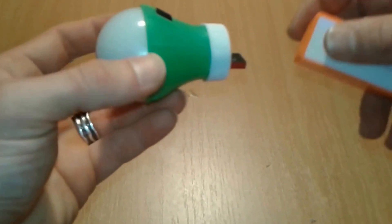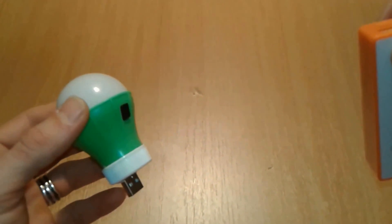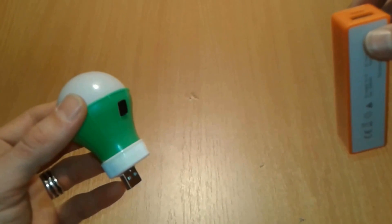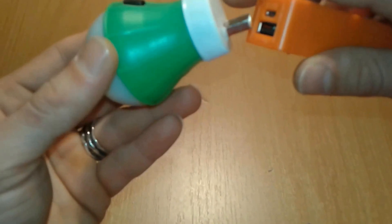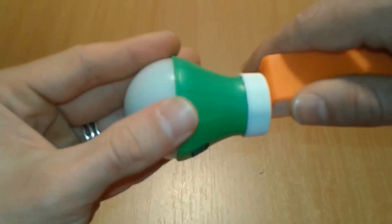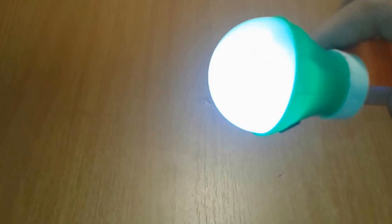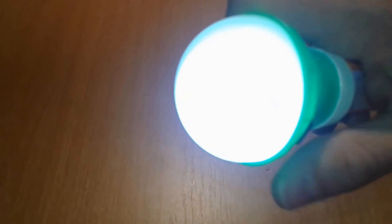It delivers 5V, and with this kind of cheap power bank it's gonna last a long while. I measured it with the diode in place — it's about 80mA, so it's gonna last a couple of hours, 7 or 8 depending on your power bank. Thanks all for watching folks, see you next time. Till then, don't be a stranger — thumbs up, subscribe and leave a comment below. Woohoo, USB rechargeable light, how about that folks!